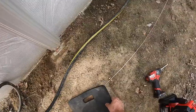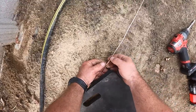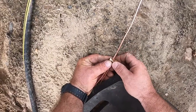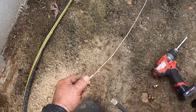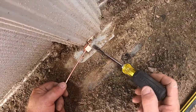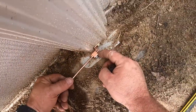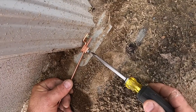You also need to attach a metal plate inside the skimmer to mechanically bond the water in the swimming pool. These split bolt connectors make the connection to the four points in the pool that need to be bonded to the equipotential bonding grid. Each one of these grounding lugs needs to be direct burial rated, which is important so they don't deteriorate over time. Chlorine eats through a lot of materials, but these are rated for direct burial, acceptable by code.